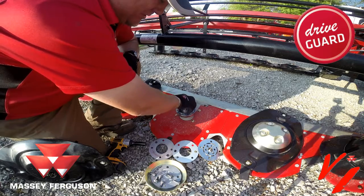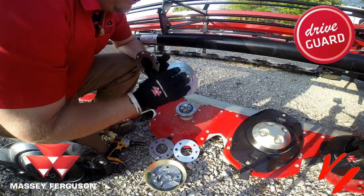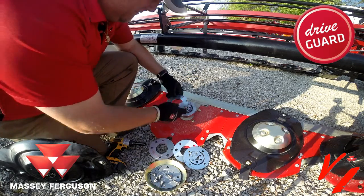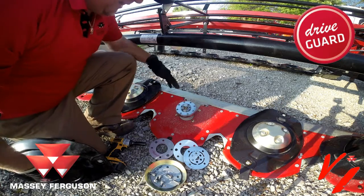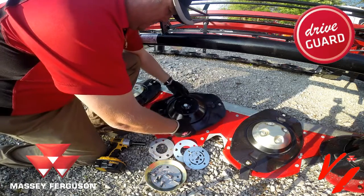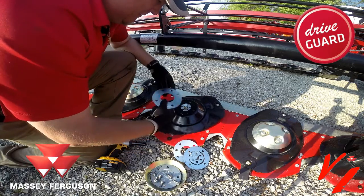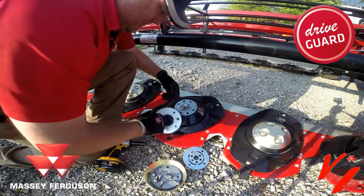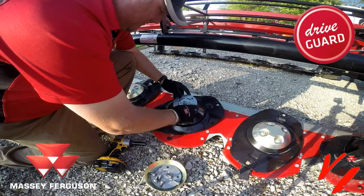This bearing does not move when everything's tied together. If you encounter an obstruction, it's going to break those four tabs there. To replace it, you won't have to go this far to get there. What I recommend is to have your disc arranged in time. Set this here — you're going to have your thick one first, then your shim, then your drive guard.